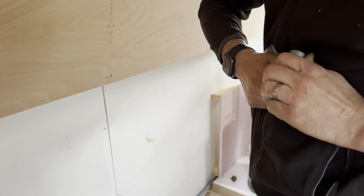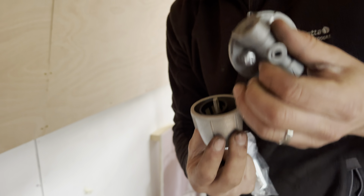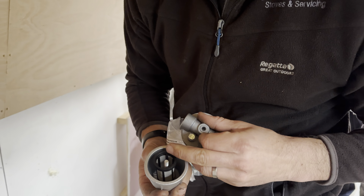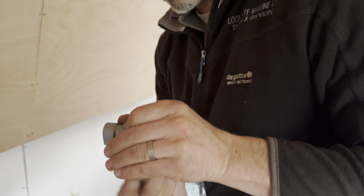So far so good. In-line filter, bowl filter - sometimes they're really tight to open, this one's not too bad. It's got an element inside there. There you are - that's a washable filter in there. Make sure the O-ring's back on when you put it back together - that screws back up.